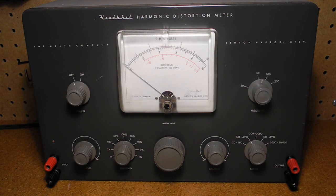With the sensitivity control on one of the voltage ranges, the level of the input signal can be measured and power calculated. If the signal source has an impedance of 600 ohms, then the power and dBm can be read directly from the meter with a suitable offset based on the range selected. The meter is calibrated with scales from 0 to 3 and 0 to 10, which are used when measuring voltage or percentage of distortion. It also shows dBm from minus 20 to plus 2, which can be used to show power and signal-to-noise ratio.